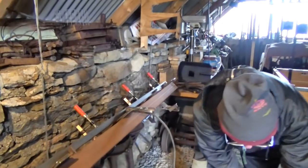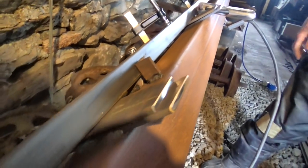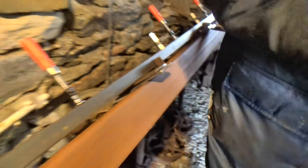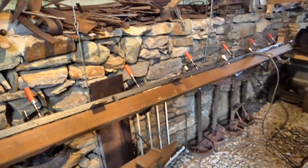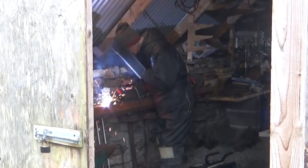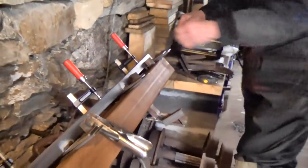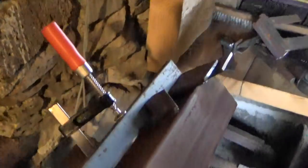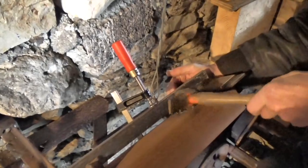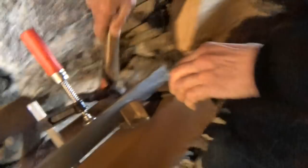The point of that is it's just so much easier to weld, when you're welding not just on the horizontal. That's it — it's pouring into the gap and it makes it much easier to weld. The jig is some box iron on a stand set up at a convenient height. The sleeper plates are positioned all along it and then the flat bar is dropped into little holders, with the pad overhanging by 22mm instead of the rail.